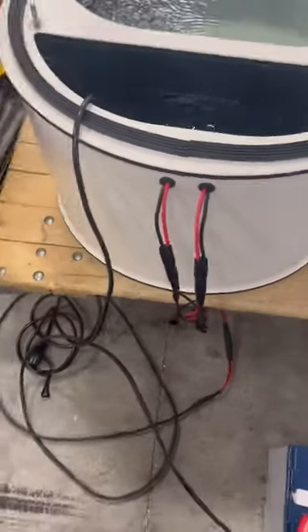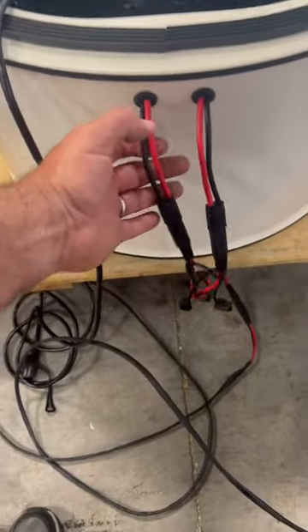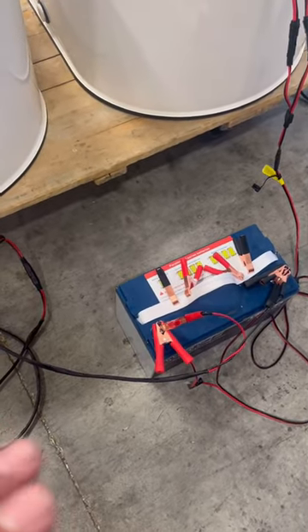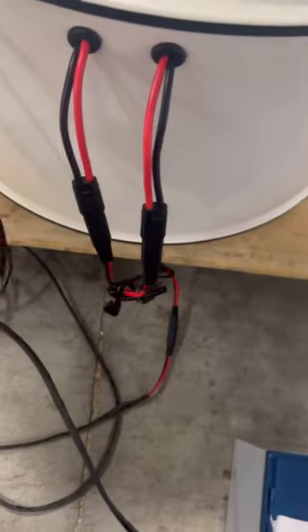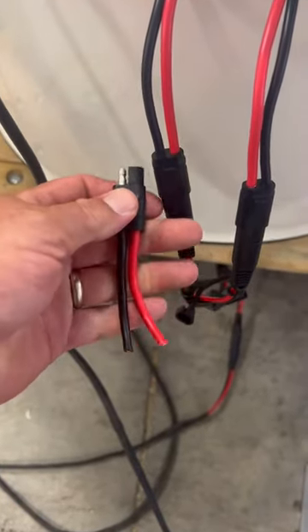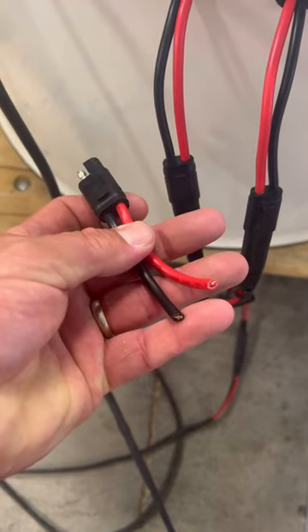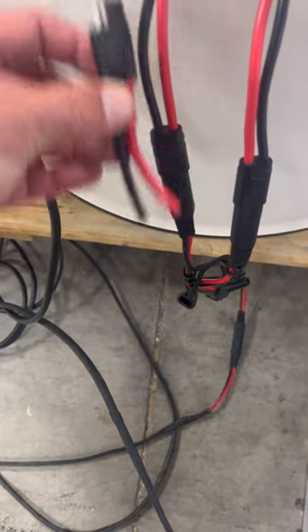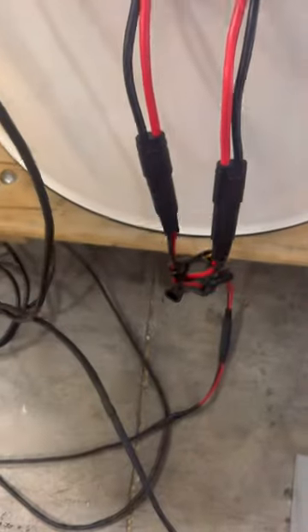There are your two quick disconnects — this is your pump, this is your light — and I just have that to a 12-volt battery. No more 24, no 36 — just 12-volt. I'm going to send you with the back half of this; it'll connect red to red, black to black. This is what you build to your power source or your battery. Always make sure you get red to red, black to black if you ever have to replace this.